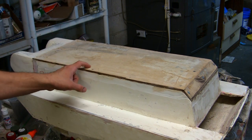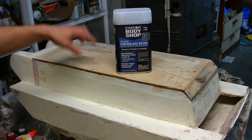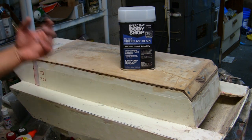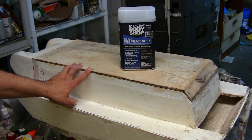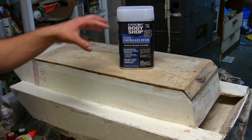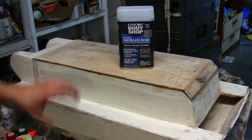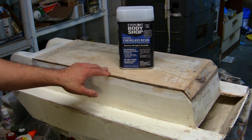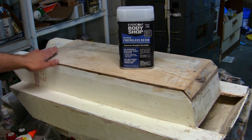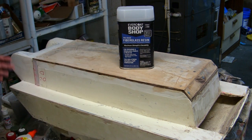First, for the material that I'm going to be coating the wood in, fiberglass resin. Fiberglass resin is a fantastic material to treat the wood surface. It basically solves and alleviates almost all of those pesky shortcomings that I mentioned this material has. The other great thing about the fiberglass is that because the wood is porous, it actually soaks up the fiberglass resin, and basically the wood becomes impregnated with it, and once the resin sets, the wood now has properties of plastic and is no longer just wood. And this makes the material, first, weatherproof, or much more weather resilient compared to just leaving it natural. The material also allows me to sand away all of the wood grain, and basically the surface becomes like plastic. And this is something that is very beneficial on a model like this.